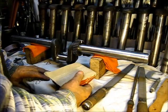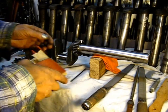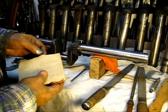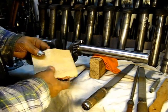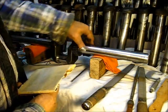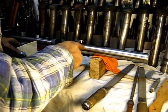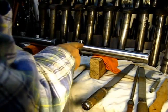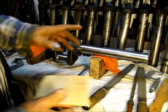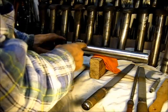Getting on with the project — I did say something about using sandpaper. This right here is that cheap stuff. The particles on this sandpaper are really hard, but the glue isn't any good. What happens is you use this cheap sandpaper on a rotating shaft or a movable shaft of any kind, and a little bitty particle gets embedded in there and it will cause you problems later. The engine starts up and runs good now, but when you disassemble it later, you will see where that little particle caused a problem.